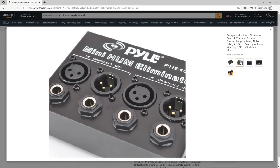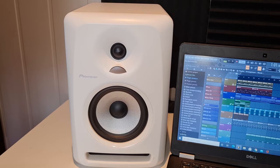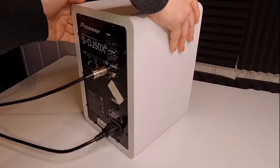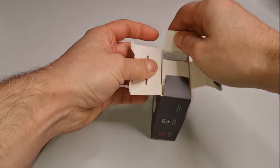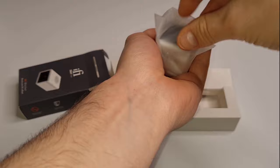If you experience a constant 50 or 60 hertz hum, it might be a ground loop issue. But if it's there consistently with only power connected, then it might be what's often referred to as transformer hum or toroidal hum. It will come from the amplifier itself. This can occur if there's any DC present on the mains. The bigger the amplifier, the more prone it tends to be for this — you can usually hear it when you put your head close to the chassis.